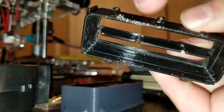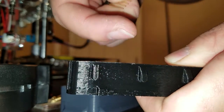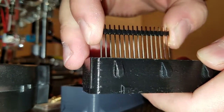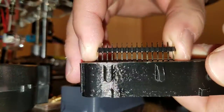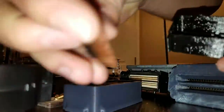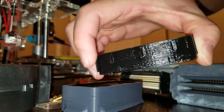This is just for fitment checks, so on the actual one I'll have to add some material to this side such that when the pins are soldered to the board and it's glued to the back, the pins are at the right depth internally so that the connector can interface with the harness side and not bottom out. You want the cam lock on top to actually be able to seat the connector all the way, so we've got to set the pin height correctly — but that shouldn't be too difficult, and once I get that I'll print another real set of these connectors.